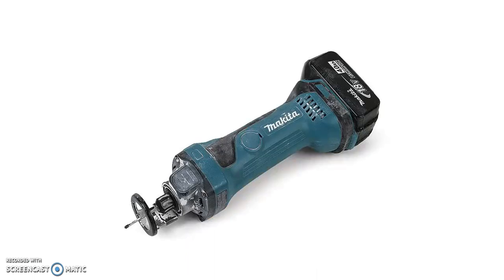This tool is actually optional, but a lot of crews use it. It's a drywall router. It makes things a lot easier, especially when you're going around things like electrical outlets or light switches. A lot of crews will hang an entire sheet over a window or door and then just cut out the section with this — the section of drywall, whether it's small or large, just pops right out, which definitely saves a lot of time.